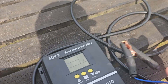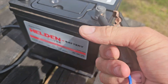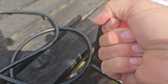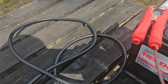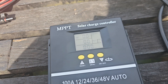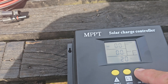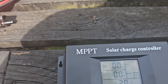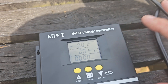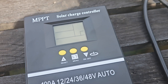Okay, so for test purposes we go to the battery now. We've got negative which is the blue one, and then positive is the red. We should have some life on the controller — and there we go. It's down to 11.6 volts. So we're looking at 11.6 volts — this is just what it's reading from the battery, not connected to anything yet. We'll disconnect it for now and wire up the solar panel.